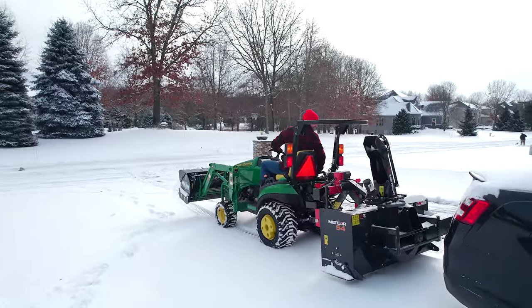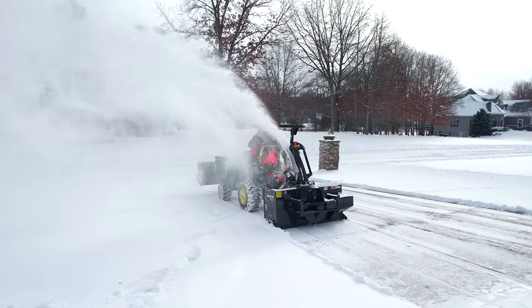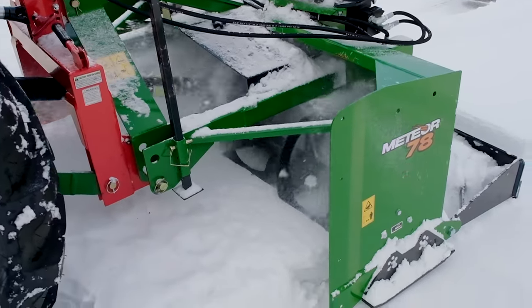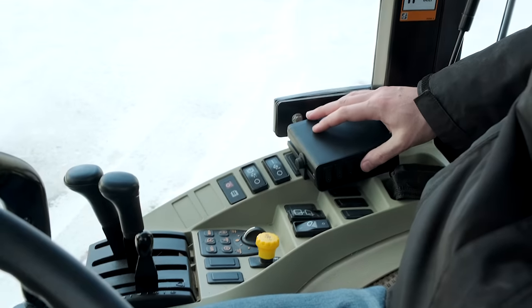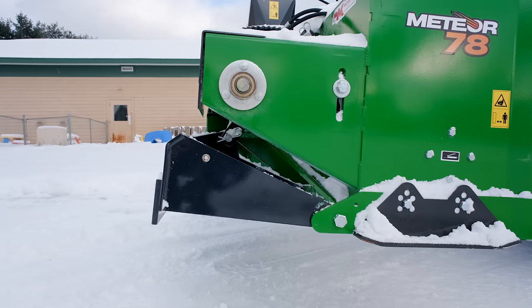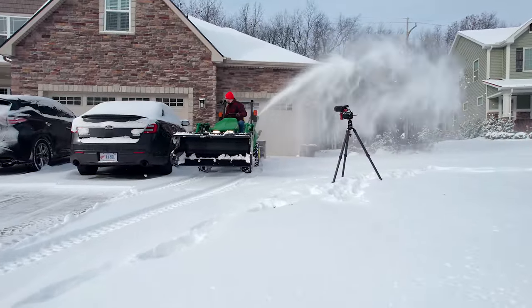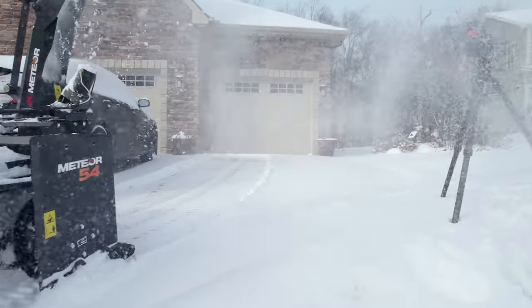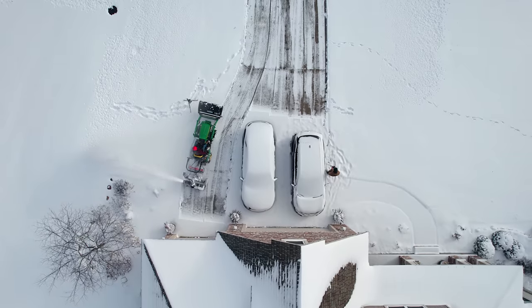Really excited - I hope we have a good winter. If the Farmer's Almanac is right we're going to have a boatload of snow. We're going to add a hydraulic chute rotation and a hydraulic deflector because I don't want to mess with that manually in freezing cold. You can get these with manual rotation or hydraulic or electric - we did an electric video last year on the 54-inch pull type. If you don't have rear hydraulics you can get electric rotation, just hook it up to your battery. You can also get a hydraulic back drag, so you can go right up to your garage door, retaining wall, or parked cars and pull all that snow away.